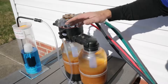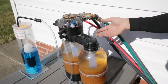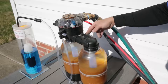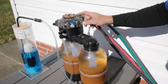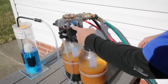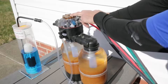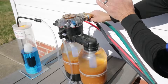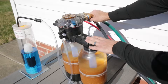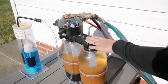All right — you saw how that process finished. Basically we're waiting for the unit to count enough gallons to use up the capacity of the tank we just finished, and then the tank we just regenerated will be turned on. With this clear cutaway view it's pretty cool — the water comes up into this section, passes through a very accurate little nozzle, blows on a turbine, and the turbine is attached to gears that connect up to the top level. That moves a ratchet on a gear and keeps track of the total number of gallons. When you reach the set capacity, it starts the process all over again. You can see that's what happens when you're using water.